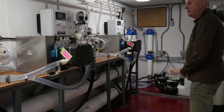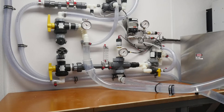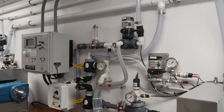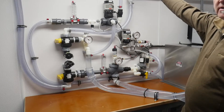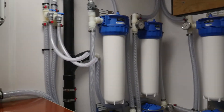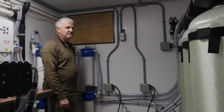One of the things we've done that we're really happy with is we've taken all of the plumbing that's normally buried behind panels and laid it out in a single plane so it's really easy to see where the water is flowing to and from. All the feed water comes in from this pipe here and runs all the way down to these filter housings. From the 5-micron filter housings it runs down that manifold to the pump, and the 5-micron filter housings are actually fed by these media filters.